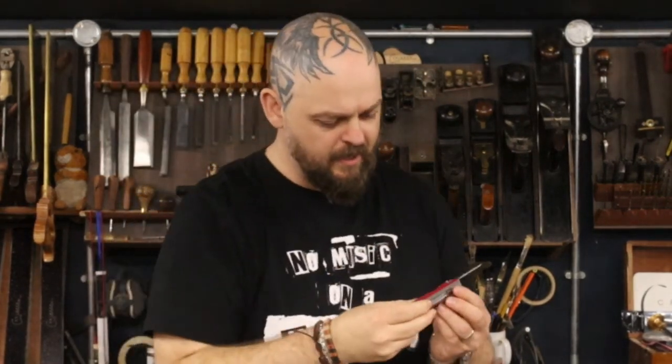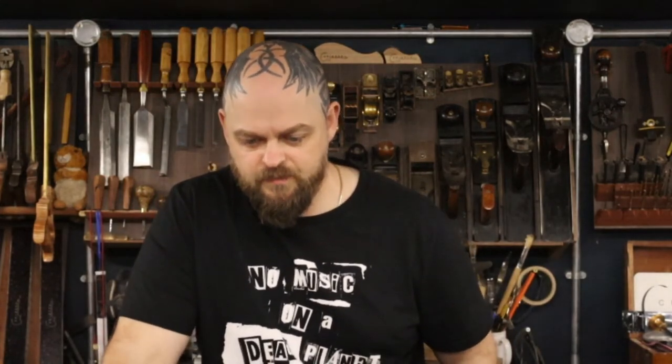Now, the first time I ever removed finish from an instrument, it was an old Ovation that fell in the river, and it was a bowl back, it was fine, but the top, the lacquer was destroyed. And I took a good sharp blade like this Leatherman Free T4 with a curved blade, and I used the sharp blade to scrape all of the finish off. And actually, that would probably be faster and better at removing the bulk of a thick lacquer off a neck than sandpaper, even. And certainly better for your lungs. And fun. You'll just make your blade blunt, which is an issue. So, yeah, I'd say scrape it with a sharp knife. Or just a scraper, if you've got a scraper. Okie dokie.